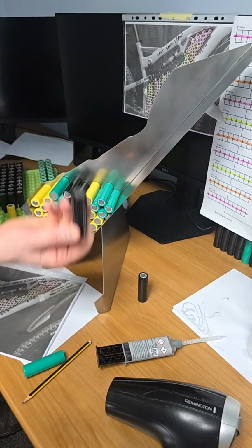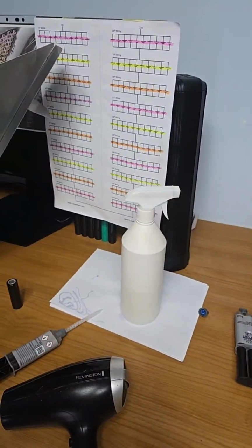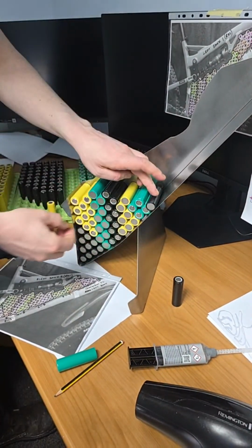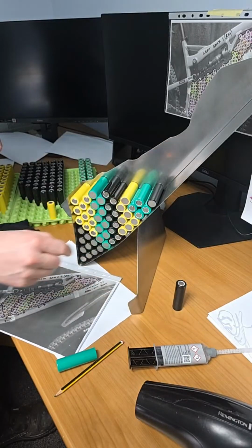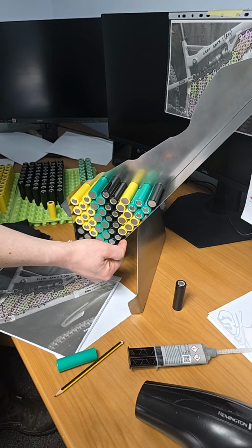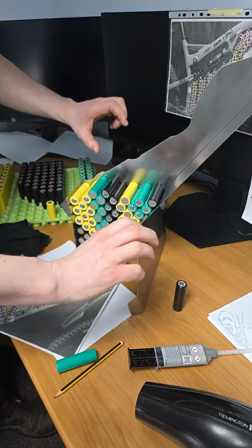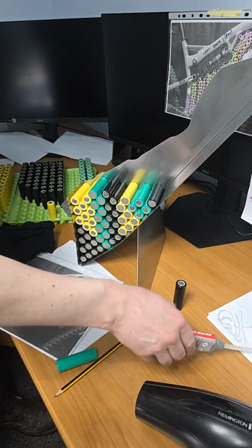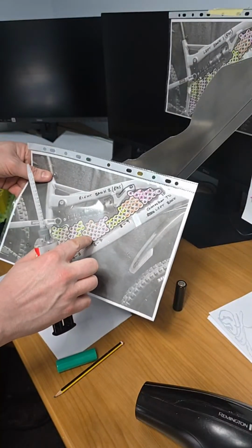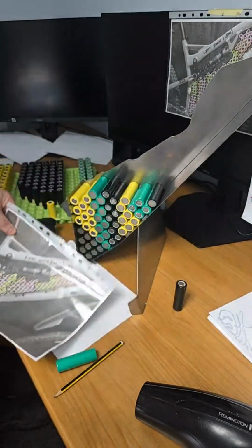So what I can do now is I can place this cell in, which is string 6, which is the purple. Remember, going back to the start of the live stream, what I explained there. So negative pole facing out. Because this gap's a wee bit tighter, because we've got the kink in the bike frame here, what I'm going to do is apply a wee bead, and then we're going to turn it into the cell, okay? So hopefully I'm making sense here. So we're now starting on string 6, which is this one, negative pole facing out. And this is the right bank.